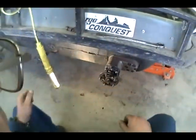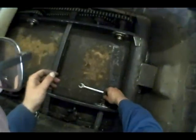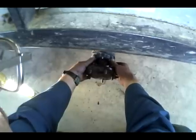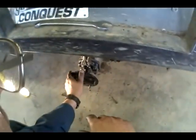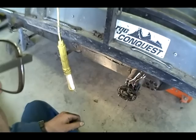Okay. Axles in. Bearing carriers are in there. We'll put our thrust washer back on. This is just to locate the shaft. We'll tighten these up, put the nuts on, tighten these up, and that'll give us our position. And once I've got that, I'll just mark it or clamp it or something like that. And that will be where I want that bearing tightened on the shaft. Butt the clamp right up against the bearing face on the inner race. Put it right there. And now, back it all off, take it out of there, and we should be able to put the set screws in place.